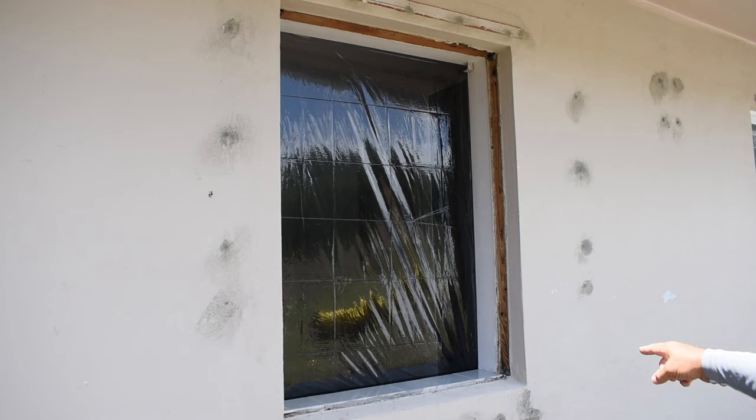After making sure this edge is nice and straight and clean, take the pressure-treated 1x3, make sure it's tight against the drywall or sheetrock or plaster, then mark all the way from top to bottom. Once this mark has been made on both sides of the window, take an angle grinder with a 4½-inch diamond blade — orient it so the great majority of the dust is going downward. You can hold a vacuum cleaner under it to suck up a lot of the dust or position a fan nearby to blow it away. Definitely have a mask on and cover your head because it gets extremely messy. You can do it in one shot from top to bottom and it doesn't take that long.